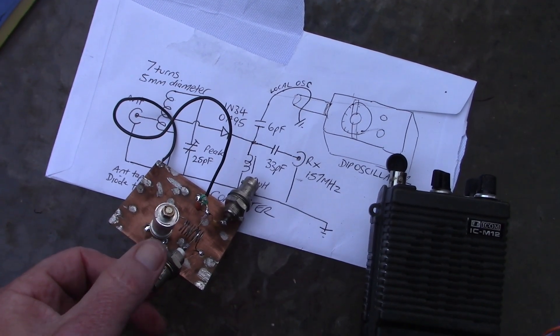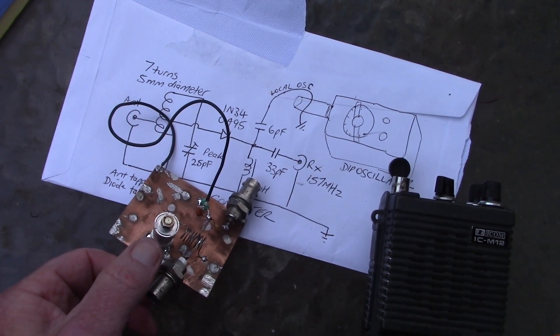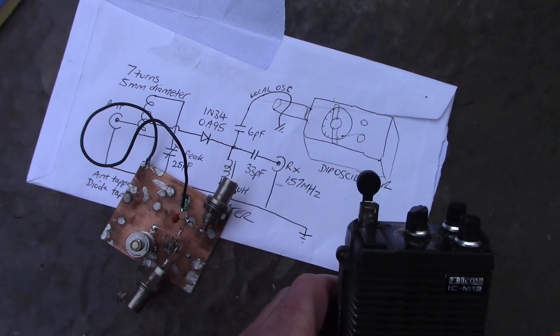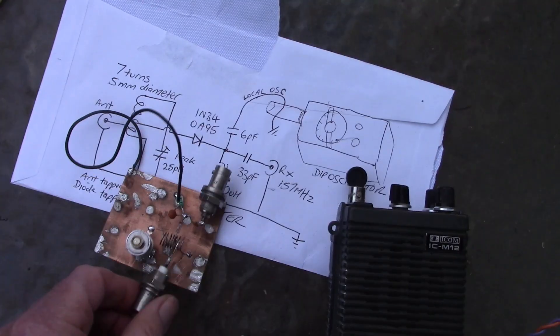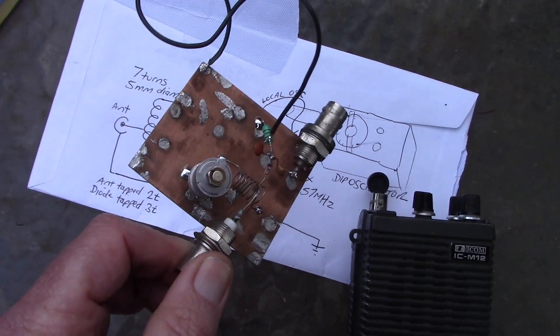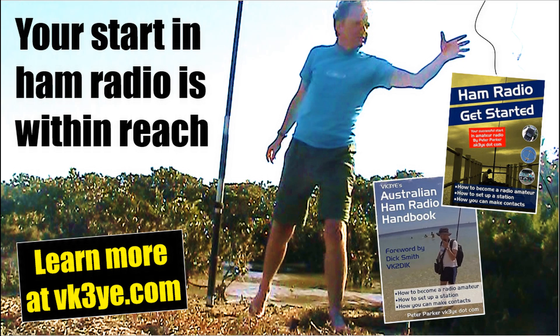So this is our super simple converter. It's probably not the most sensitive because there is no gain in the mixer. If you want to receive local VHF FM amateur activity and some other communications that might be in your area, and all you have is a junk-box super-cheap marine band transceiver like this, then that can be a very good IF. And as it's such a good IF, it's a really good quality piece of equipment. You can take some shortcuts like with super simple converters like this and hear at least some signals. Enjoy these videos? Want to start in amateur radio? Check out my books — Ham Radio Get Started for USA readers, and the Australian Ham Radio Handbook for those in Australia. For more information visit my website vk3ye.com, or search their titles on Amazon. Thank you very much for watching, and we'll see you next time!